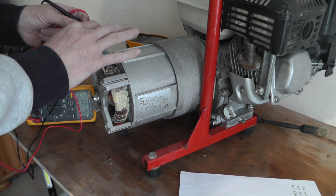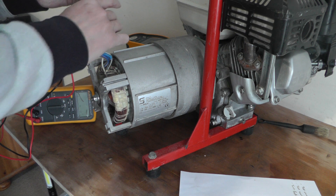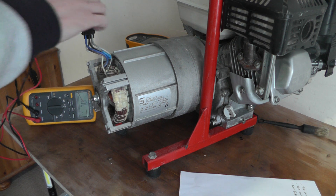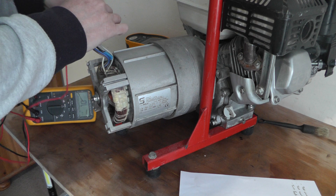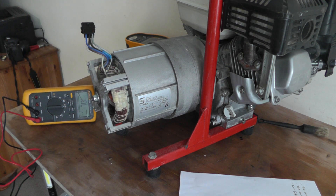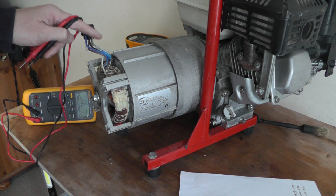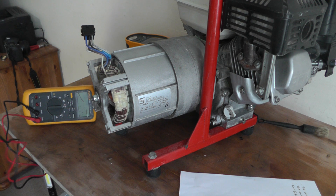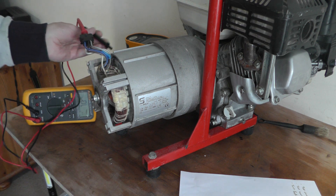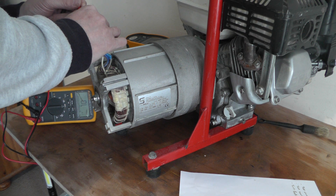The gray one and gray two wires are your capacitor winding — that's got 5.5 ohms. I'll test both sides to earth: no connection to earth, which is good. I'm not going to put an insulation resistance test on that because it's only a 5 volt winding, so I don't really want to be putting high voltage down it. It could potentially cause damage, so let's go find the other windings.